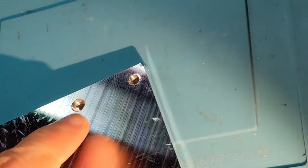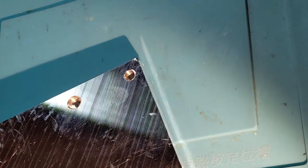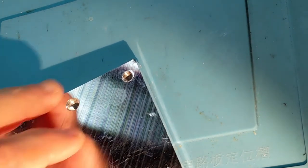The holes have come out quite well — nice and smooth, no sharp edges. If I spin it around this way, like I said, put a tap in these, so you can probably just make out the screw thread there so that the M5 will stick. I can't try it because I don't have any M5 screws, it turns out. And the counter sunk hole there — it's a lovely piece of metal. It looks lovely and flat too, so we shall have to see how it goes.